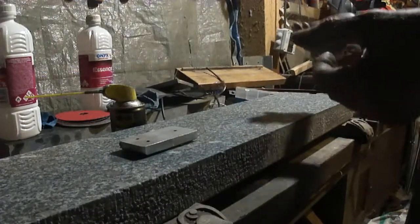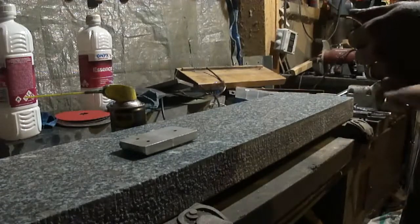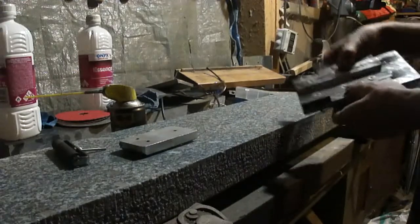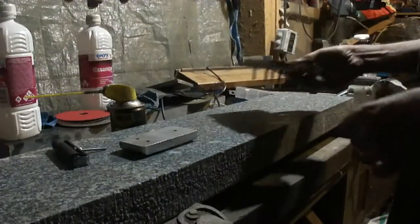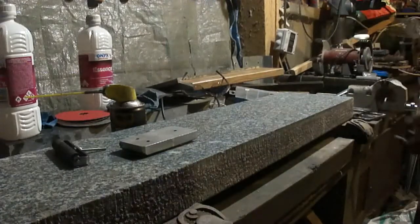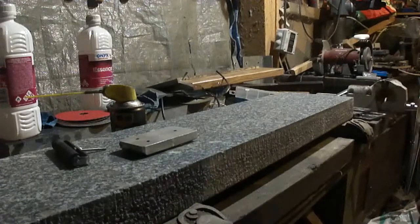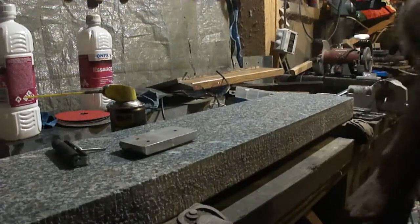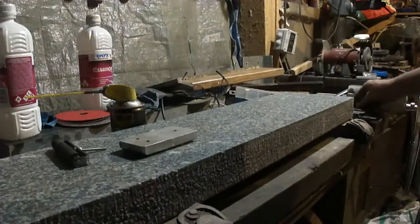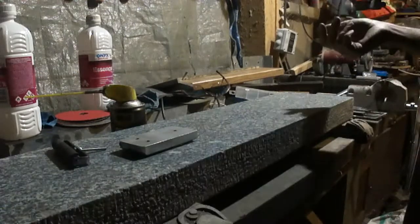That's fine — I don't need to go any lower unless it's just for completeness. I've been using the plate quite a lot, and I've been playing with what's known as the Russian rectifier, which is an angle grinder with a sanding disc. The technique is exactly the same as scraping: you take your piece of steel, ink up your surface plate, mark it, then use the angle grinder with a sanding disc to remove material. It'll get you down to within scraping range very rapidly — it's much faster than using a file. For my test pieces it's actually good enough; I'm making a little slide arrangement.